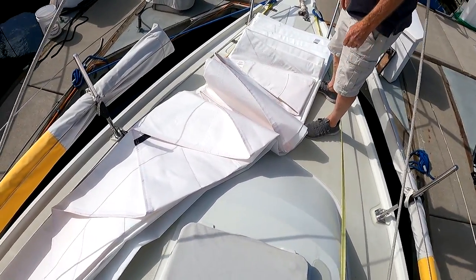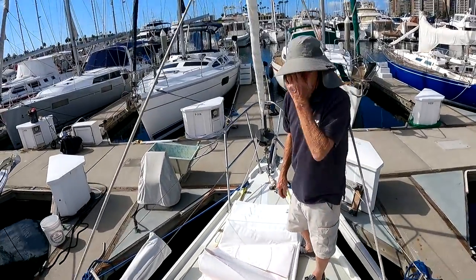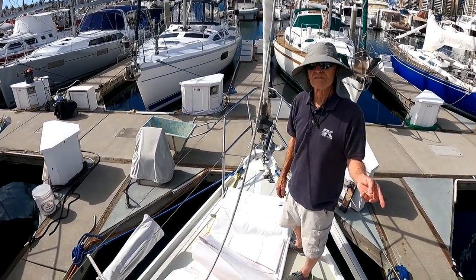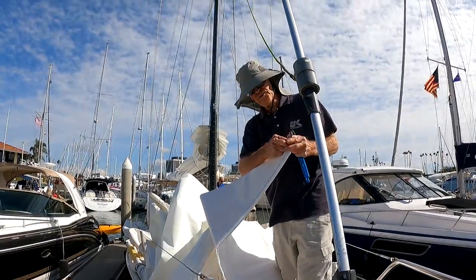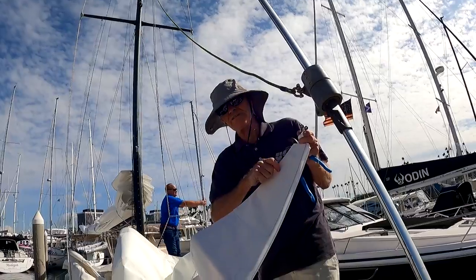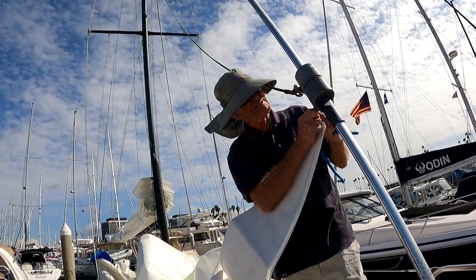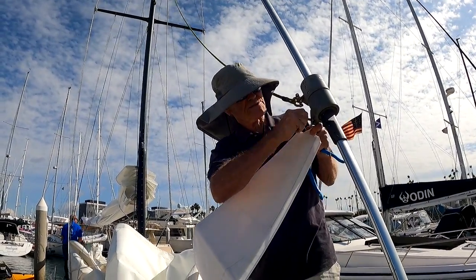What is the weight of this genoa cloth? This is 6.5 ounce. In the old days sails were generally lighter than they are now — they've probably gone up about an ounce. Your last one was 8.4, which was a smaller sail. This is a 135. These are prone to breaking because nowadays most sail makers use webbing at the head and tack so that it rolls up tighter instead of rings. We use spectra webbing because this gets exposed to the sun chronically — the polyester stuff will tend to deteriorate. A very common thing is for people to suddenly find, while sailing along, that their sail comes down because the webbing breaks.